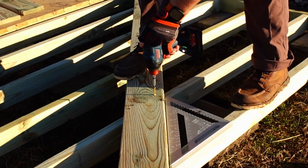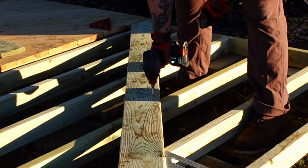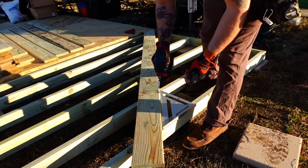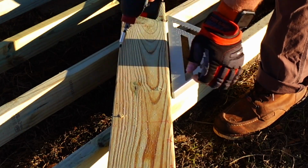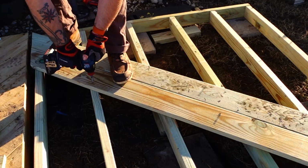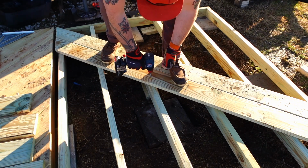so don't forget. Now another quick note here is that these planks in particular are still super wet from the treatment processing, so I'm just going to be butting them right up against each other. If you have lumber that has already dried quite a bit, you're going to want to add gaps to your liking before you start screwing them down.